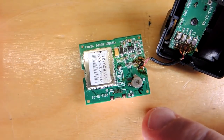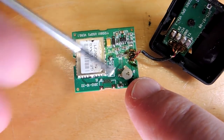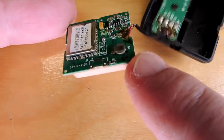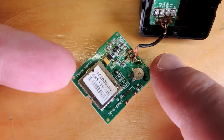Some unfortunate design choices you can see immediately. This is a battery which has been welded into place, so it's impossible to replace. Unfortunately that kind of guarantees planned obsolescence because the battery eventually will lose its charge, and I should imagine the module starts to malfunction. I don't think that's what happened to my dash cam though — the actual power circuit in the dash cam also failed.